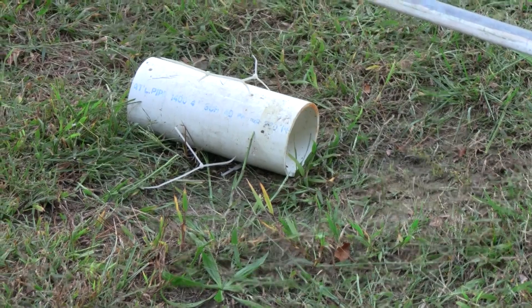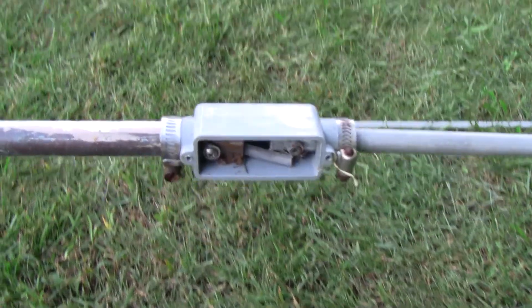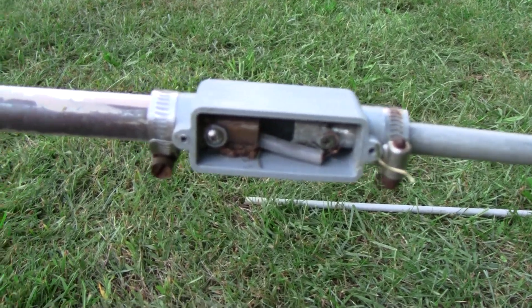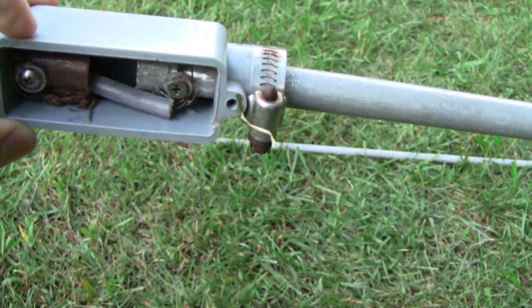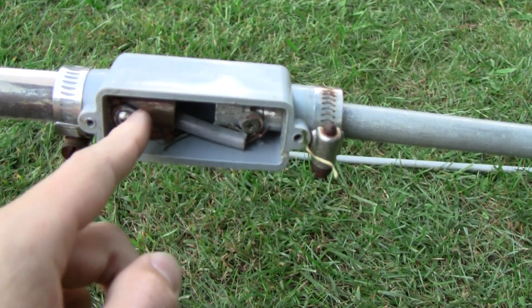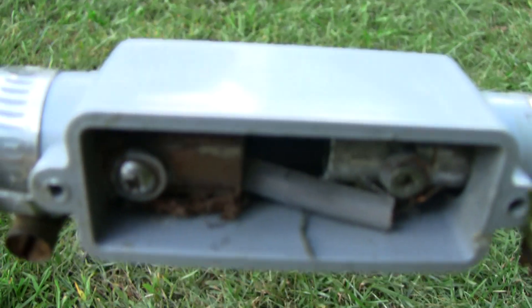It's not like that four-inch piece of PVC was expensive — I had that lying around the house. Almost everything on this antenna I built from stuff I had around the house. The only thing I didn't build is the center box here — it's just a three-quarter-inch PVC conduit junction box, pretty cheap, maybe three to six dollars. My coax comes up through the middle and through the bottom element, held on with a hose clamp. The coax has an outer braid and a shielded inner signal wire — the braid goes to the bottom element (your ground) and the signal wire goes to the top.